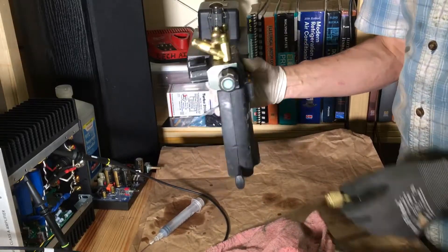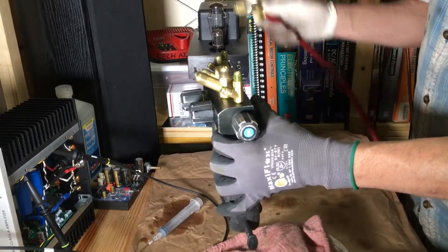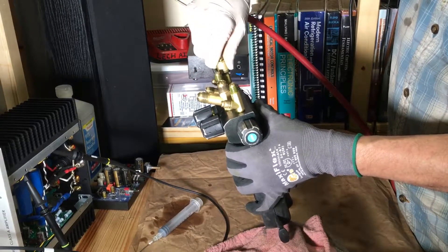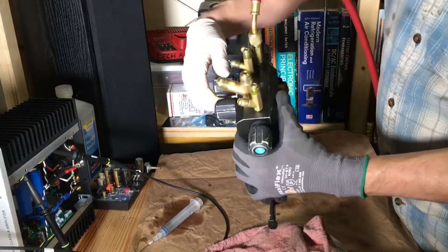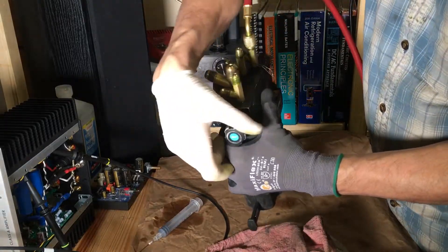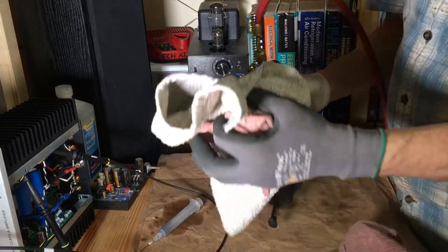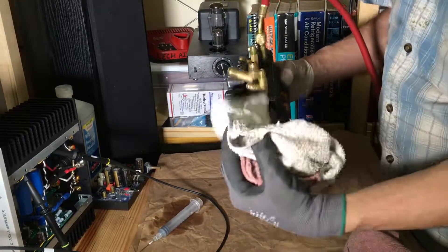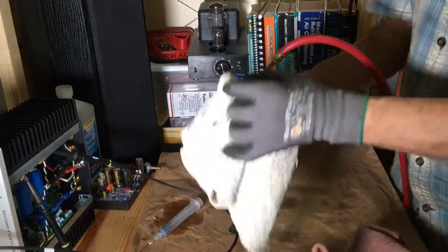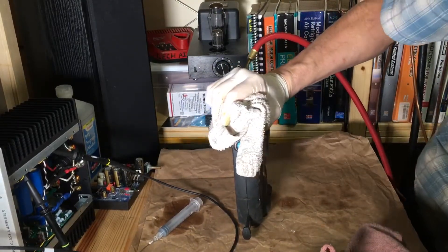Now, if I was outside, I would put my nitrogen on full blast — with eye protection, of course, because you don't want alcohol spraying in your eye, and you don't want any stream of high pressure air. I just put it on one side and let it blow across in one direction. So I got this closed, this closed, I got this one over here open, and this one over here open. I'm going to grab my rag because I have dye in this too — you might be able to see the slight green tint there of the dye. So let's do this, I'll just hold my hand here because I know I'm going to have a little bit of mess, and I'll open up my nitrogen.